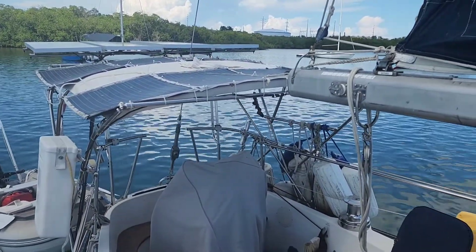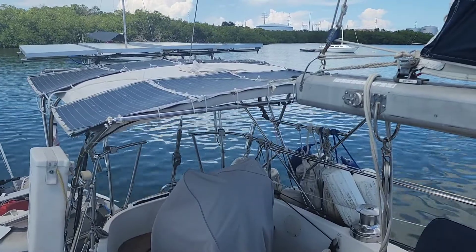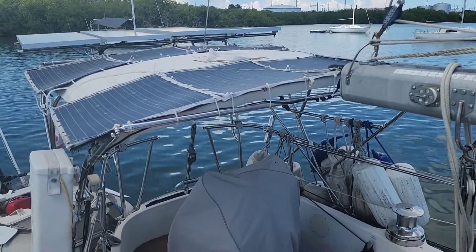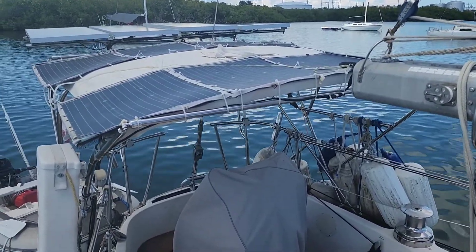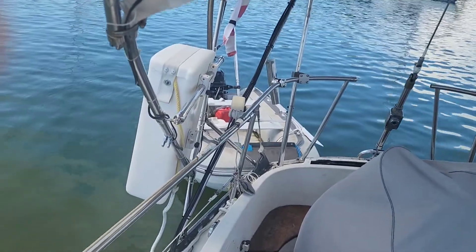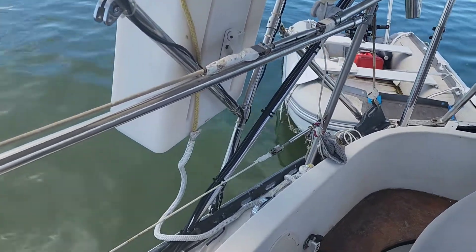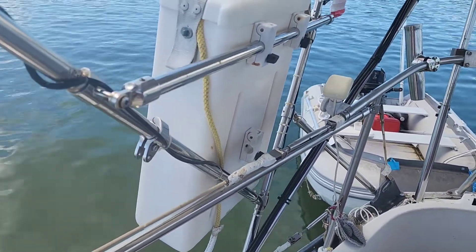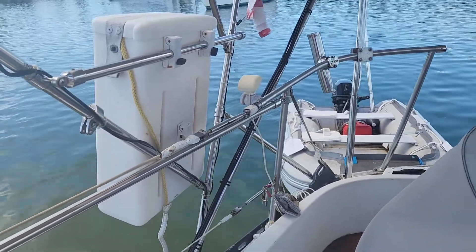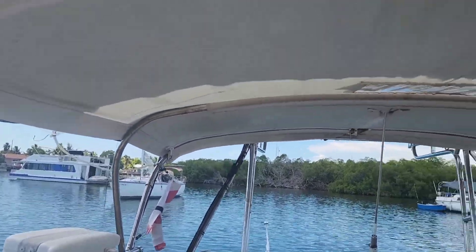Biminis are fairly flimsy, but the shade is worth having them. As you can see, we're cruising — we've mounted semi-flexible solar panels to the top of ours and are probably going to upgrade to solid panels because these are aging and fading; they're two years old. One of the problems with adding weight to your bimini is they're flimsy, and adding weight doesn't make them stronger, so this makes them susceptible to storm damage — not just hurricanes, but thunderstorms that produce 60, 70, 80 mile-an-hour winds — and there's a lot of surface area for them to catch.